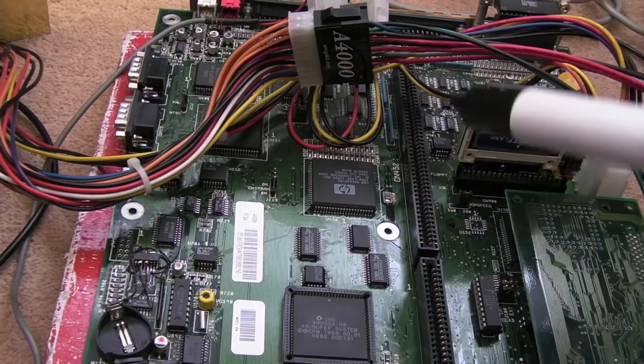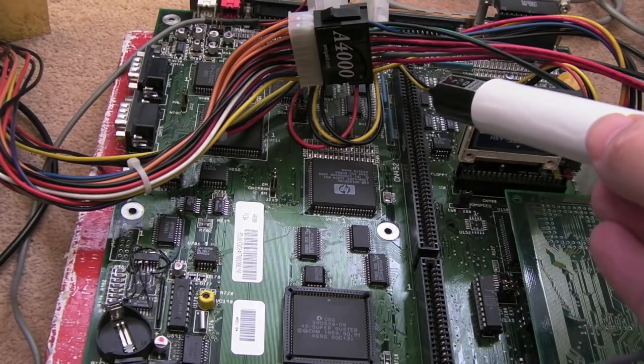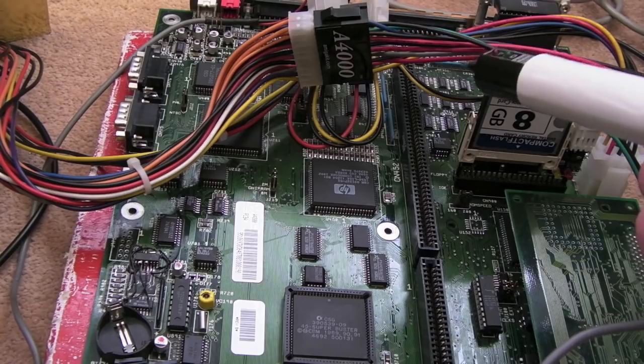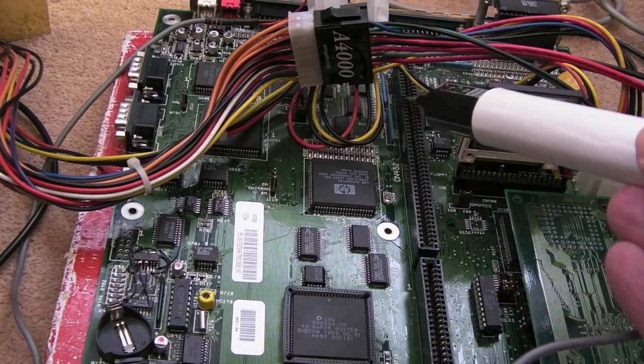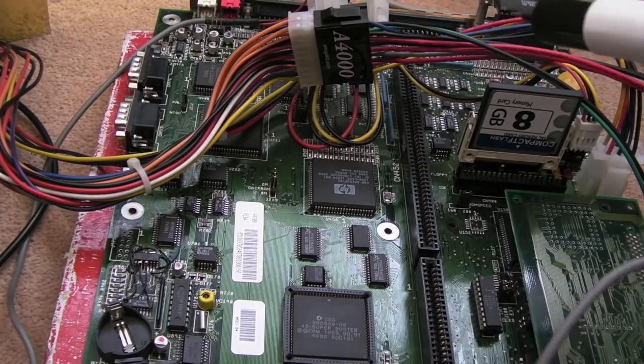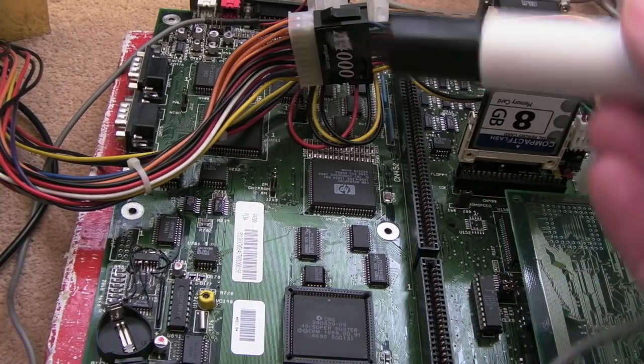It's got to be, I think, if we assume the GALs, you know, PALs, GALs, whatever they are, are okay, I think it's unlikely that both boards have both chips faulty. We saw the same behaviour as we swapped one by one, each chip around the IDE section there. It's got to be a feeding signal.